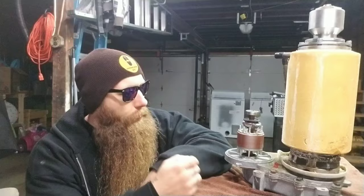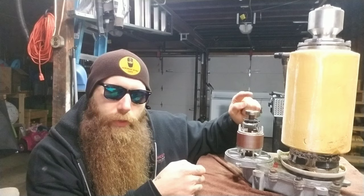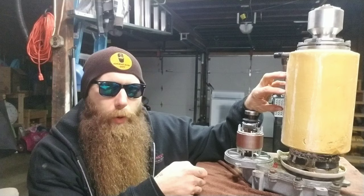In this episode of Garage Science with the Curious HVAC Guy, this right here is the evaporator barrel out of an Iceomatic ice machine. I don't know exactly what happened to it, but I do know this rotor that's left on the gearbox spins rather freely. So I'm guessing there's an issue inside the gearbox, possibly with the spindle that's attached to the bottom of this rotor. The other thing that I've found just a handful of times is the bearing will go bad on this and the auger, or the screw inside this evaporator barrel, will jam up.